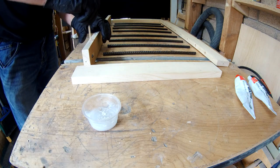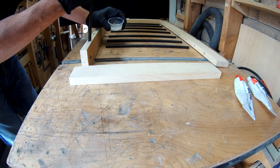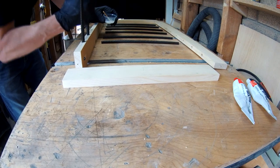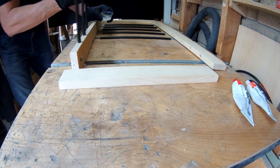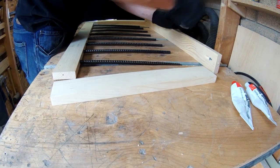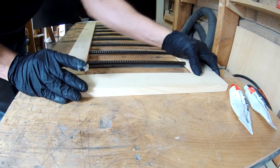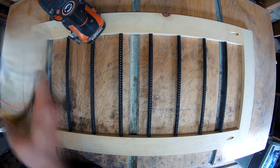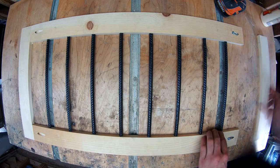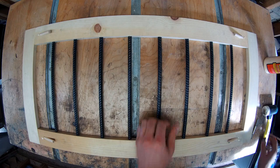This is a little bit of a tricky step figuring out how much epoxy to put in without getting too much squeeze out. This completely depends on the diameter of the hole that you drilled and the length of the rebar, so I went pretty light on the epoxy for the first few holes until I figured out just the right amount. Once I've got all the pieces in place I'll press the long rails of the frame together, making sure to keep it perfectly in line with the side rails, then I'll reassemble the frame with the pocket hole screws and add some dowel plugs to hide the screws for a nice aesthetic. There are a lot of ways to do this step but I wanted to see how well pocket holes would hold the frame together using just one screw and glue — I must say I'm pretty impressed with the result, I don't see this frame going anywhere.